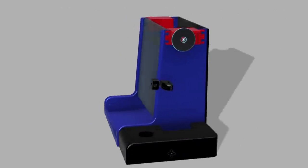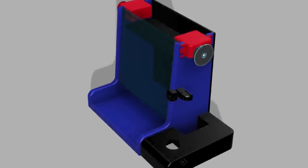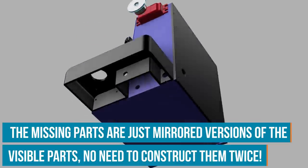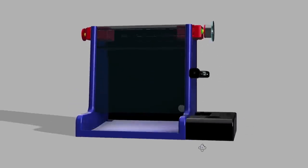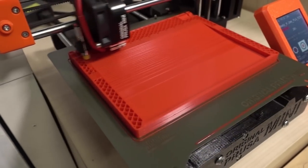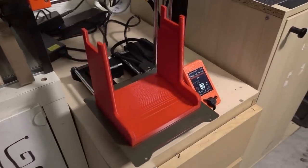The design was done in Fusion 360. That's really convenient, so I can have multiple iterations. It took me a few tries to make everything fit. I plan on using two continuous rotation servos, so they are already in the design. And some of the parts I build when I have the pieces assembled and know what will work. All these parts are designed for a printer that has a little bit less than 20 by 20 centimeters print volume, so you can print that on any commonly available 3D printer.